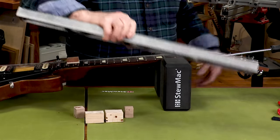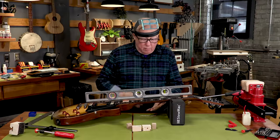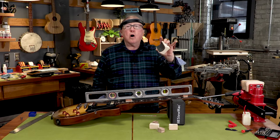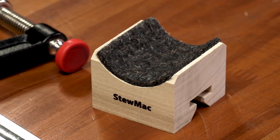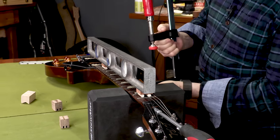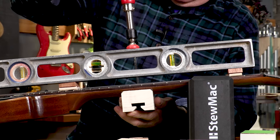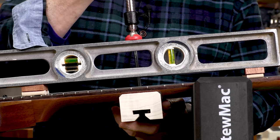Next, we span those blocks with something long and strong — could be a piece of two-by-four. This is a carpenter's level that my dad had when I was a kid. The idea is I'm going to clamp this and that's going to clamp the neck into a back bow. I'm taking a clamp and this is a caul — C-A-U-L, that's what we call these. This caul is specially made for this purpose and for fret jobs, clamping fingerboards on. It's curved and padded to go on the back of the neck. If you don't have a block like this, a piece of foam or a sanding block would work — you just don't want to crush the back of the neck with the clamp. I'm going to come right in the middle of the neck, about the seventh to the ninth fret, and tighten up real good. Clamping this neck into a back bow first takes a lot of strain off the truss rod to straighten the neck.